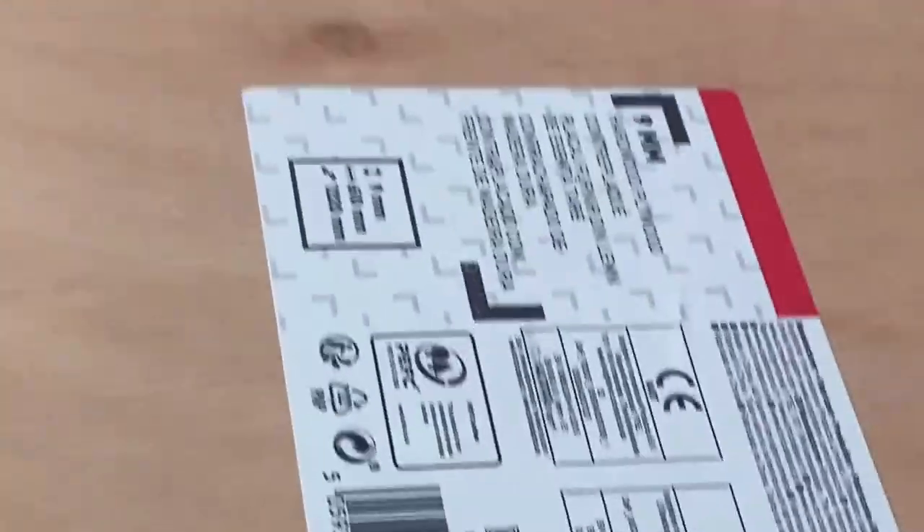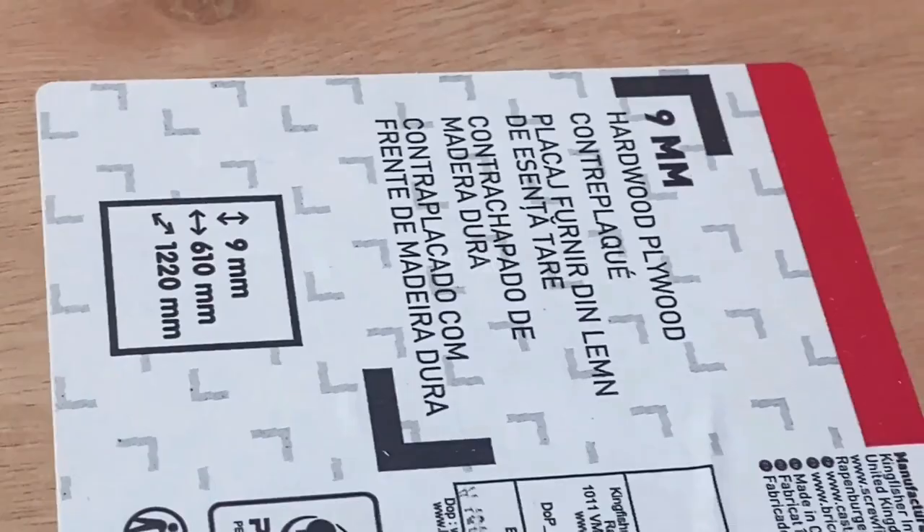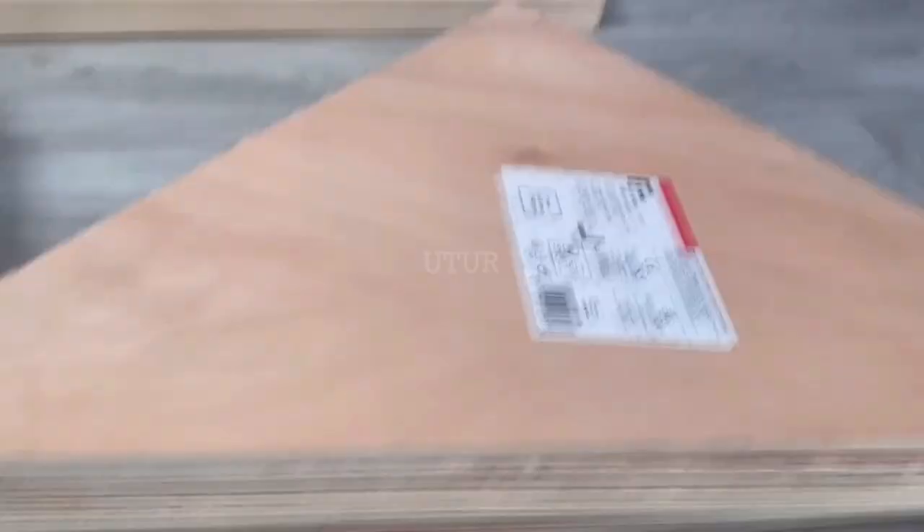For quality cuts, make sure you select quality blades. We haven't used the appropriate blade in this instance — click on the link in the description to see why. The blade just about does a good job getting fine quality cuts around the edges of the hardwood plywood, which is important because you'll have your acoustic fabric around the perimeter of the top and bottom hardwood plywood base boards. We've now got eight hardwood plywood diagonal section boards that have been cut.